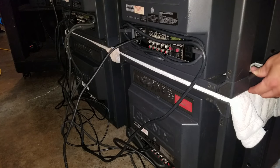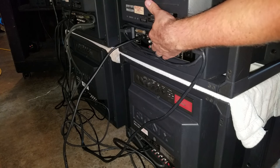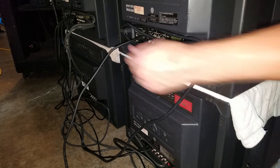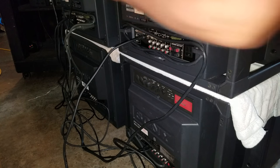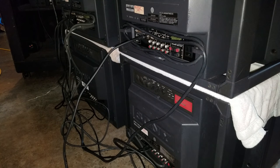When you have your BNCs hooked up on this monitor, you do need to make sure that the 75-ohm resistor switches are all turned off if you're going out. If you're doing a daisy chain out of a monitor, you have to turn that 75-ohm resistor off, and then the very last monitor in your loop, make sure it's on — the 75-ohm. So I've got all of them turned off. This is the last one in the loop, and it's selected to on.